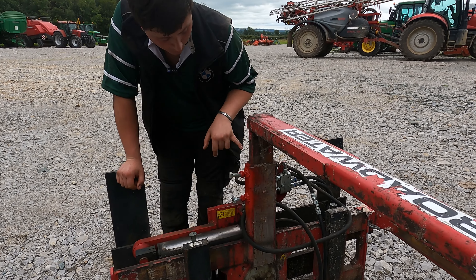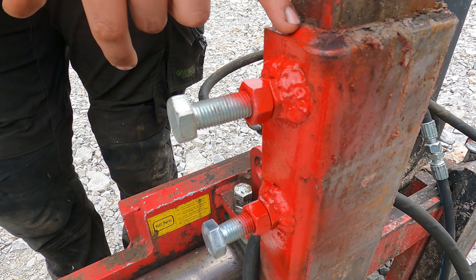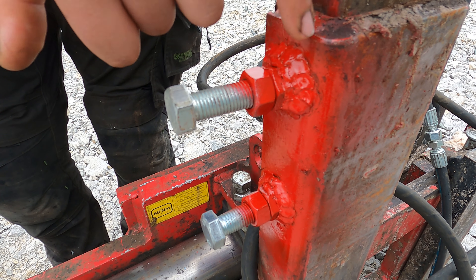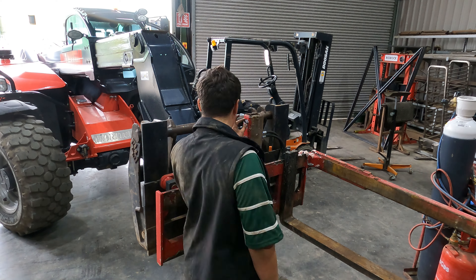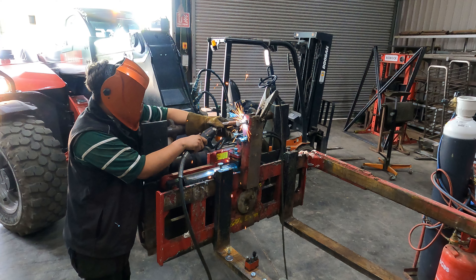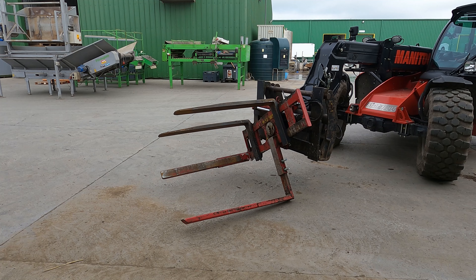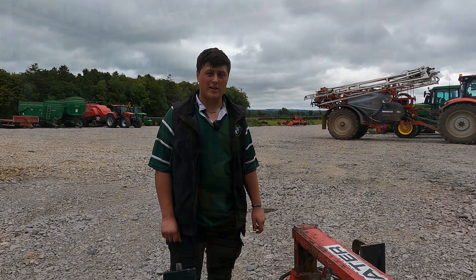Here on the side where it clamps the hole in the bar, the steel was threaded but the threads were pulled inside. So all I done was I cleaned the insides out with the die grinder so it's not threaded anymore, and welded on these nuts — they're held by lock nuts. It's a fairly simple job to do, but that's just the repair to keep that machine moving. I can only imagine the threads will wear again and we'll be doing the same thing, but that's just part of the joys of it.